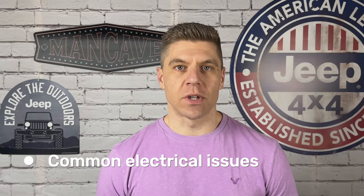Now let's talk about diagnosing some common electrical issues. I get asked a whole myriad of questions about the finicky electronics on these things. Some of the most common ones are: I've lost my throttle and reverse but I still have steering; what does this blinking light do; why is my servo jittering; why do I have throttle but no steering? Thankfully they're pretty easy solutions for the most part — a lot of it can be fixed with just the transmitter, some simple fixes and tweaks, and some is just replacing weak factory electronics with upgraded units.